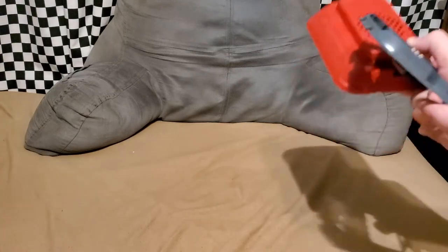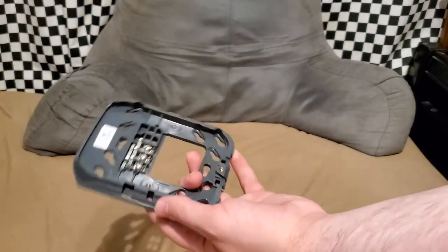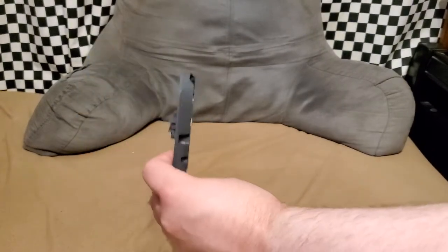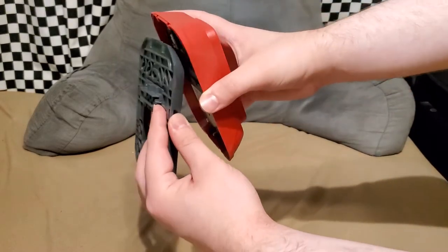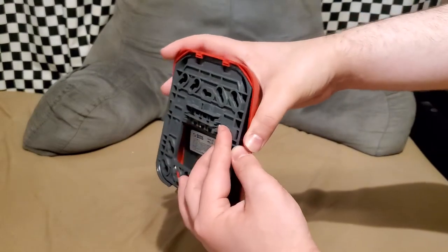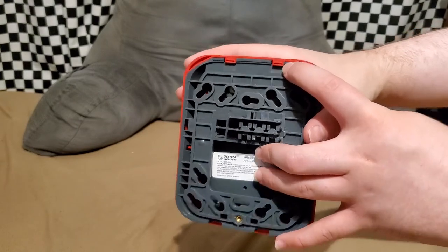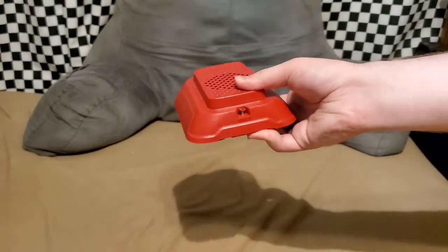To put this on a wall, you have your mounting plate wired up — this also applies for ceiling mount versions. Once the mounting plate is on the wall and wired up, you pop the sounder on, making sure the two tabs on the top of the case slide right into the mounting plate. Then you push it on and secure it with the screw.